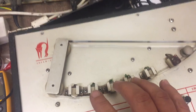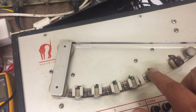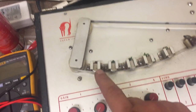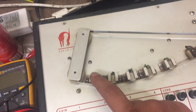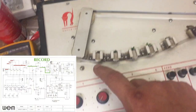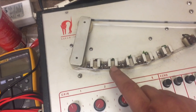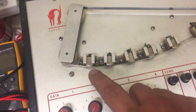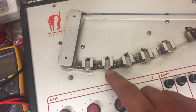These are the four playheads. One, two, three, four. What happens is you hit a chord with your guitar, channel one. It's recorded onto the tape with this head. At the moment you go with your big chord, jang! And it's picked up again by the first delay playhead here, after it's traveled this distance. This is what's determining the real delay.